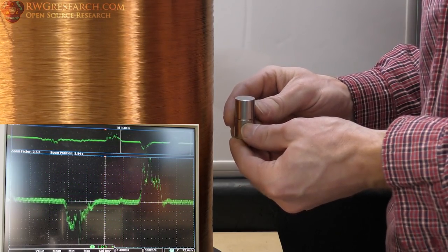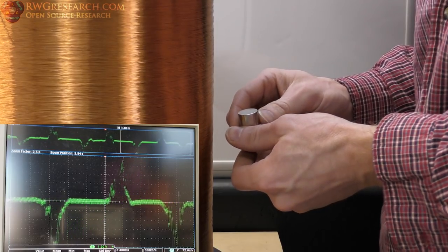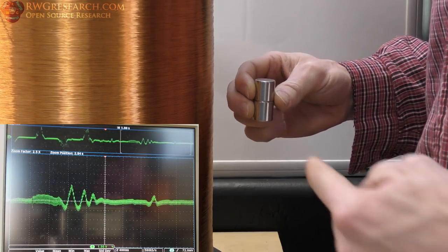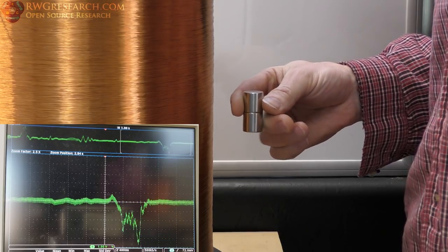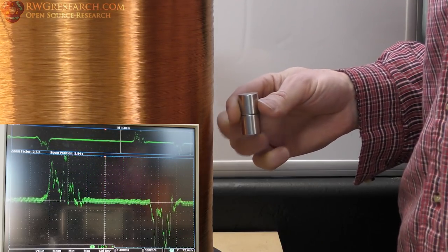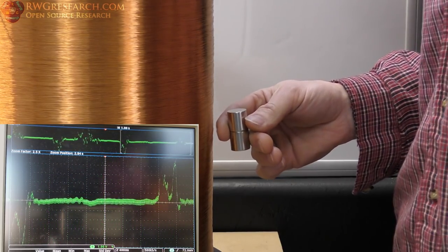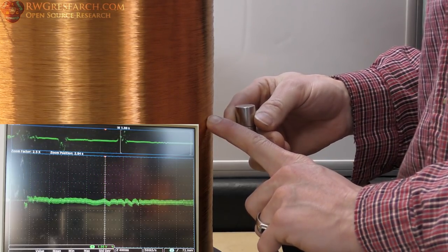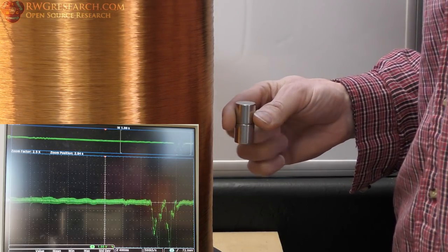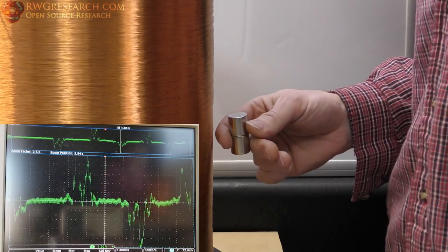Now I'm having a hard time flipping it and not making it rock. But the idea here is that if you can get the coil to align the magnet, and the power being applied is in the same direction as the induction through the magnetic flux into the coil, the same direction, then everything is going in the same direction. There is zero cogging, and the magnet is actually aligning itself. And if the induction currents from the magnet are big enough, it will actually create a magnetic field in the coil stronger than what the voltage and current is being applied. So everything is constantly working together and nothing is fighting.